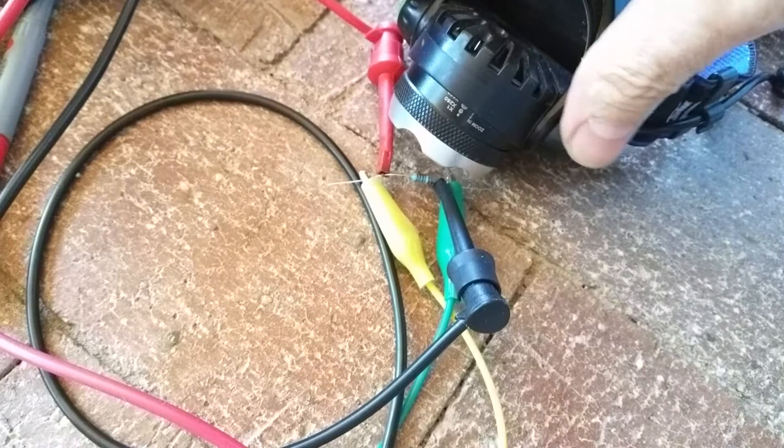I'm going to pause for a bit to wait for it to come back down — it's going to take a long time because of Newton's law of cooling. After about two minutes, we're down to two-tenths of an ohm, one-tenth of an ohm of delta from baseline. If the resistor is coming back to within a tenth of an ohm after a heating event, I think that's pretty astounding. The stability of this meter is mind-blowing once you get the switches back in shape.